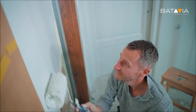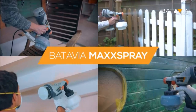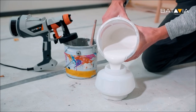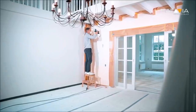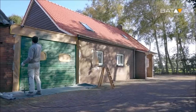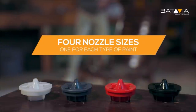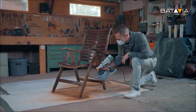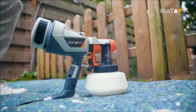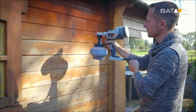Batavia Paint Sprayer. 500 watt paint sprayer. The high speed motor makes it compatible with thinner paint like oil based enamel, acrylic and latex, etc. A paint sprayer uses a high volume of air to push paint through the tip, along with a low pressure airstream that produces a mist-like spray pattern. They work best at a 6 to 8 inch spray distance and create a finer finish. Meanwhile, it prevents wasting paint and overspray.